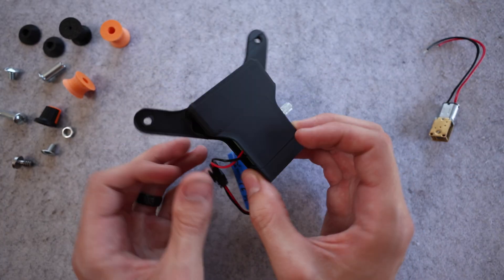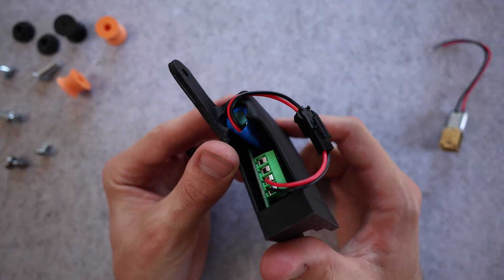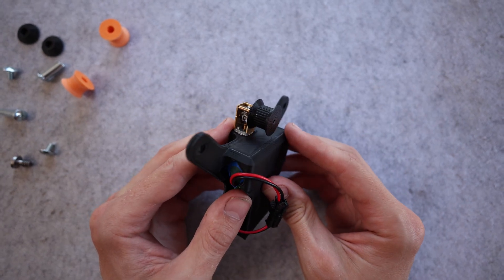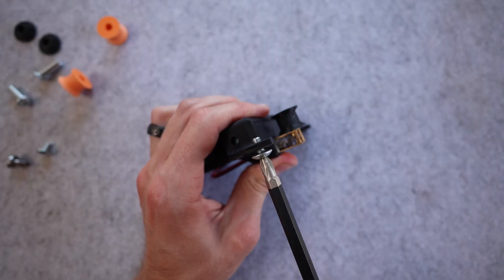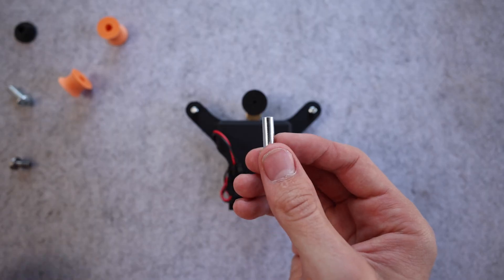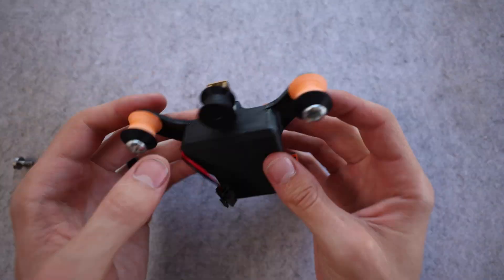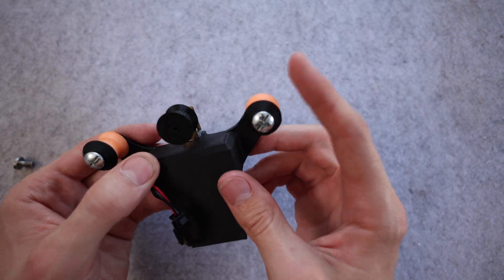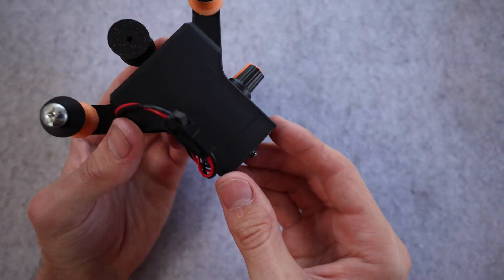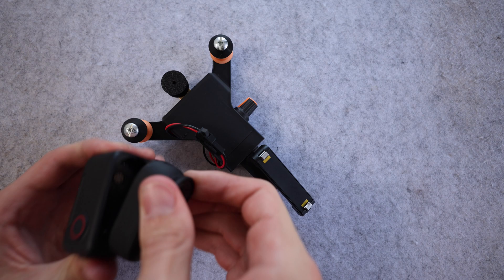This turned out really nice. The controls fit perfectly, the battery compartment is perfect, and the slot for the motor and the wheel that attaches to the motor have this really nice friction fit so they don't need any glue to stay in place. The only thing that's not 3D printed on this zipline are the two metal studs that needed to be really smooth so that the wheels would spin nice and freely. On the bottom there's a notch for sliding in a quarter inch screw, which I can then attach the mounting plate for the Insta360 GO 3.